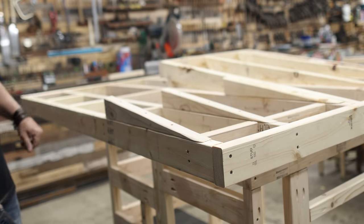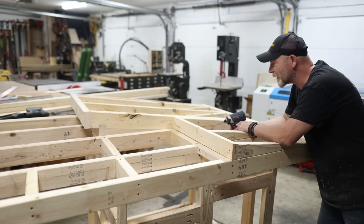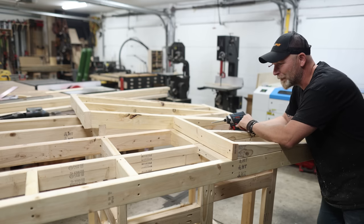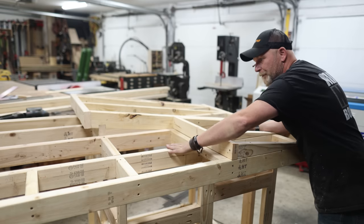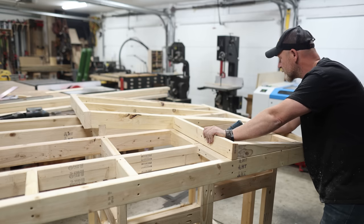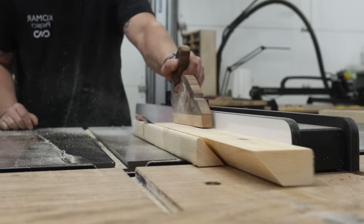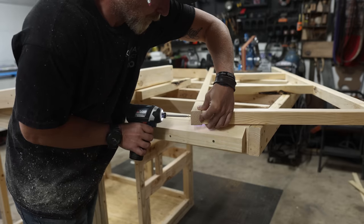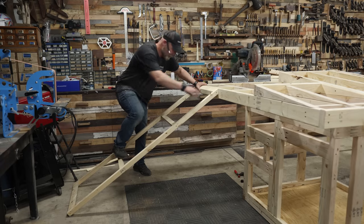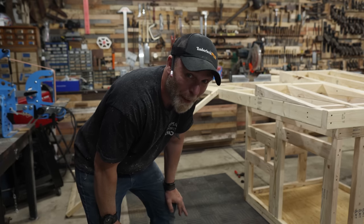After building out the soffits to the bottom portion of the roof, I attached the fascia board all the way around and added some 2x4 wedges to follow that second tier roof line on the back side. This will create a little step for the puppies and give more surface area on that top tier — their 'chilling up here, leave me alone' area. It's their doghouse and they can use it any way they want. I think that's the roof right there, and it's gonna do perfect for the puppies — they've got a ramp, they can jump up, lay up here, whatever. It's more like a dog amusement park than a doghouse.